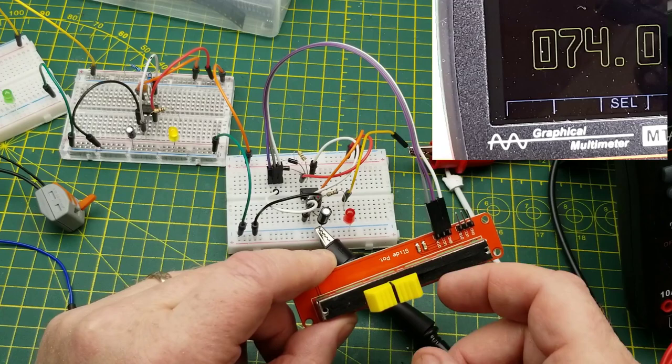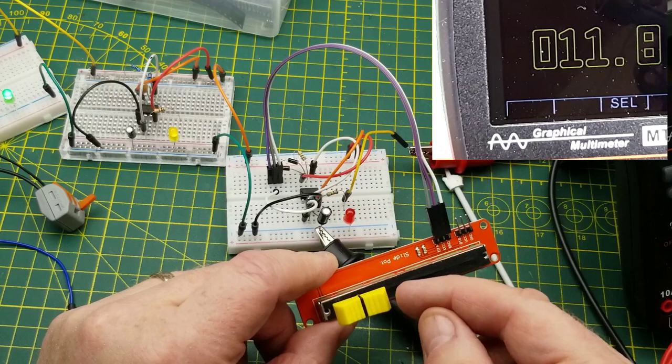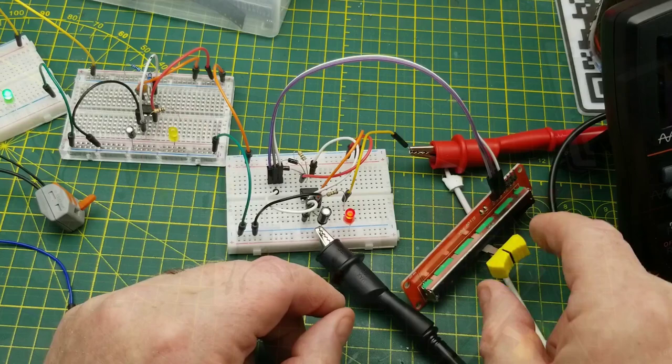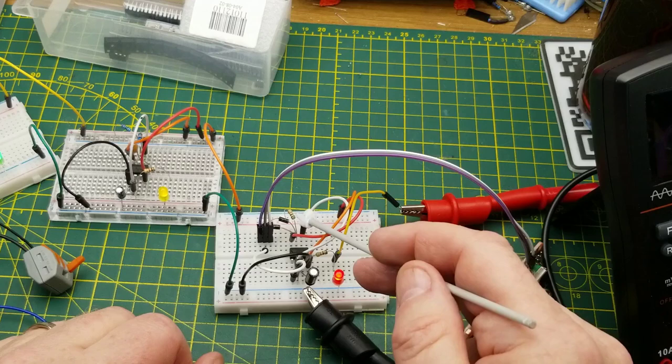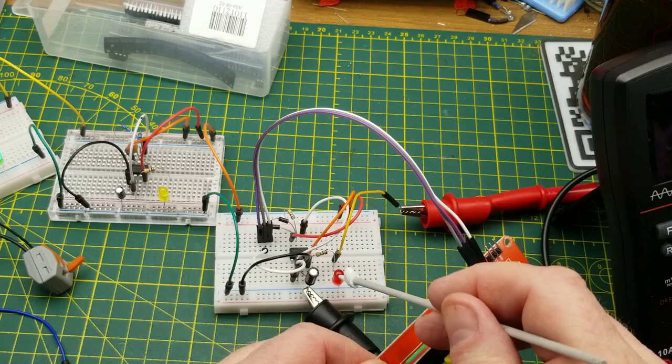And you can see the pulse speed, and you can see on the counter what's going on here. So you can go to really quick little pulses, strobe-like pulses almost, or it just gently flickers off and it's on most of the time. And then if you wanted this one to also be variable frequency, you could adjust this resistor here. Right now it's a fairly low value, but again, you could adjust that, and in combination with adjusting what this is, you could get variable frequency and variable pulse width within whatever range that capacitor allows.